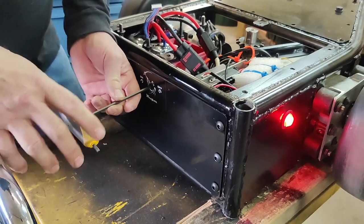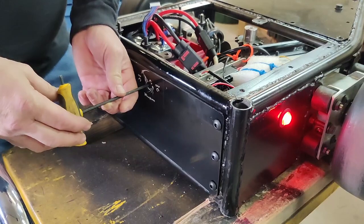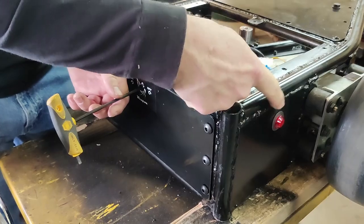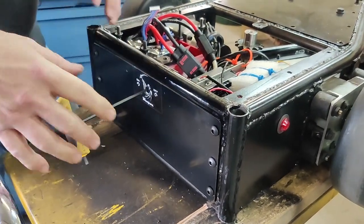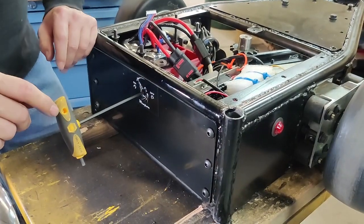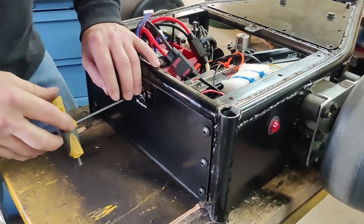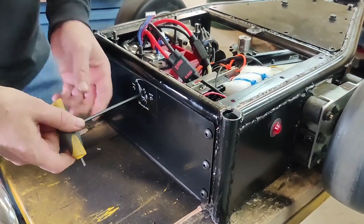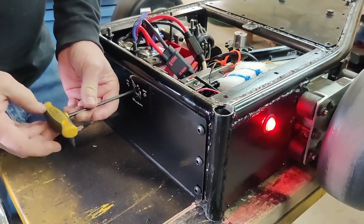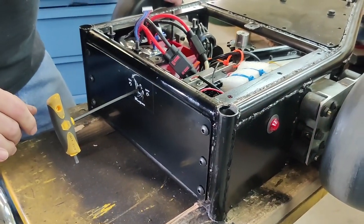The one thing that people catch wrong is when they turn it off. I'm starting to feel resistance — that is off. But you can see it takes a bit for that light to go out. This is normal. You've got capacitors in the speed controls and it takes a bit for that power to bleed out of the system. So don't think you have to keep cranking it down just because the light didn't go immediately off — it takes a few seconds. This is literally on and off. You can do everything in less than a turn on this switch; you don't need to go all the way in and out.